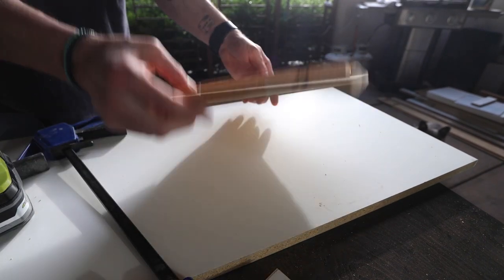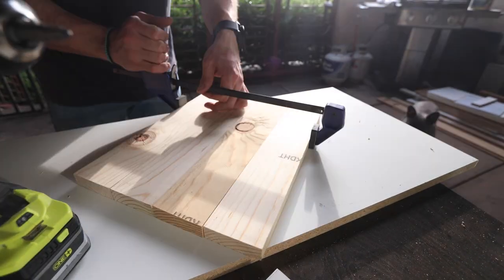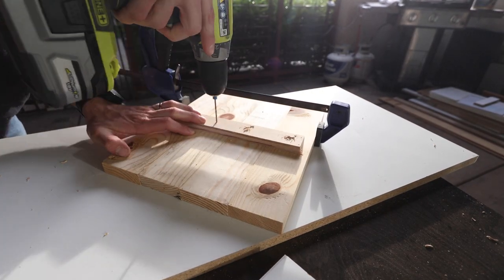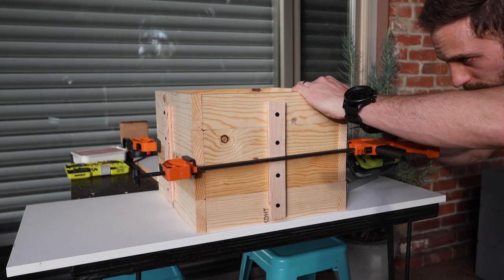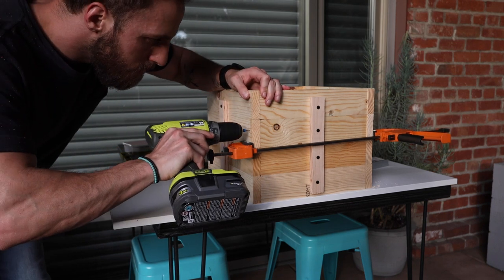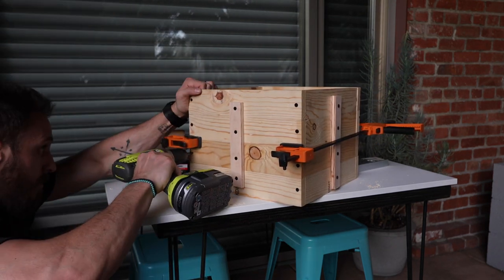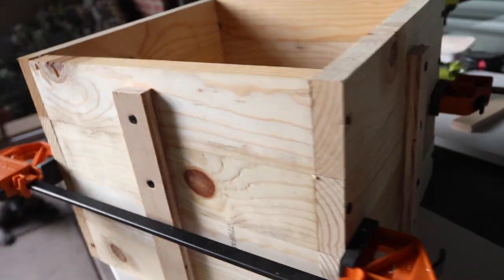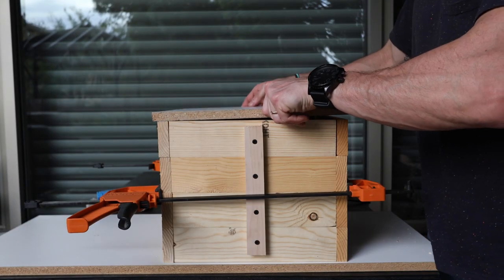These panels that I am putting together will make up the walls of the concrete mold. I then repeated this process three more times. I put each panel together into a square and clamped them tight. Once again I pre-drilled and screwed together each wall. Now it was time to cut a piece for the base of the mold. For this I used some melamine that I had from an old shelf, and then attached it to one of the ends of the box.